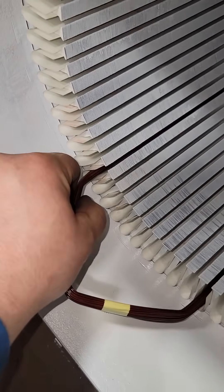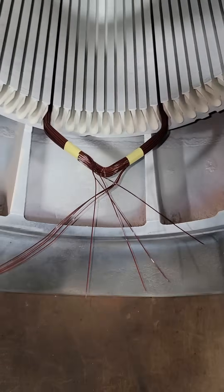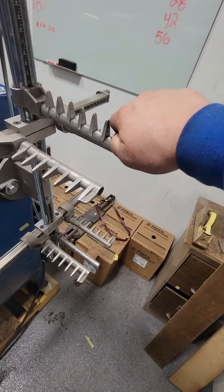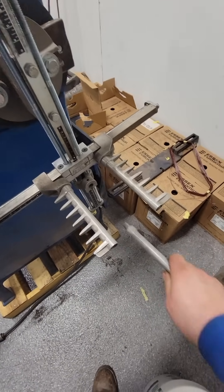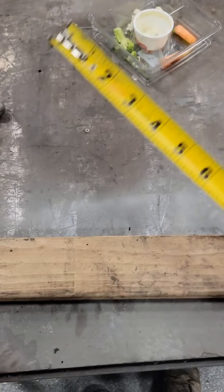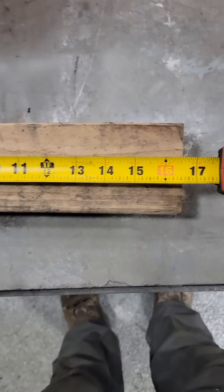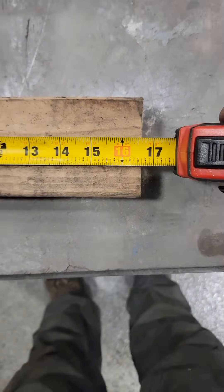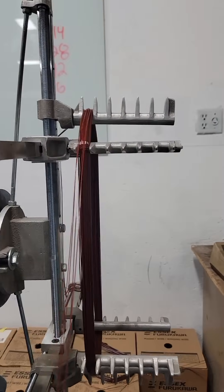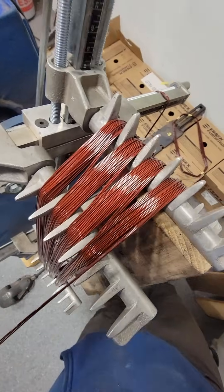We are currently in the market for a new winding head. I did find a used one to replace the one I showed in this video, but even the used one is ten thousand dollars. The current problem with this winding head is we have a lot of deflection — these parts are all loose, they're worn out, some of them just kind of pull out, they're not even held in there anymore. We want all of our coils to be exactly the same dimensions so they fit right inside of each other and we can keep everything even. I was searching for a piece of wood that was 16 and five-eighths and I found this exact piece. So you've got to kind of come up with some band-aids to get this job done. Once I get one coil on there you can see that top bar is bent down — we can wedge that piece of wood in there and just fully brace this winding so we can get a better, even shape.